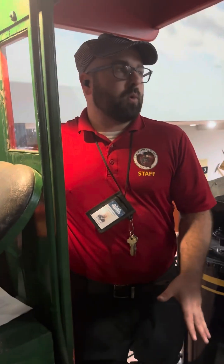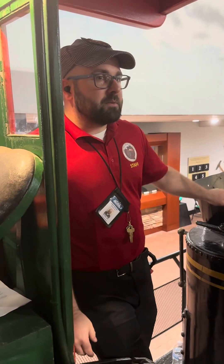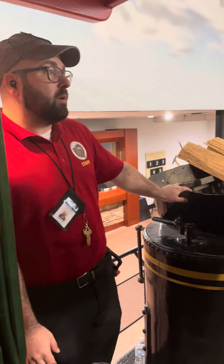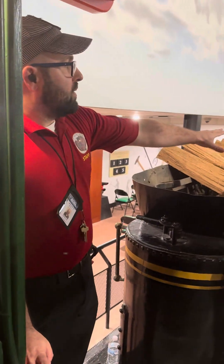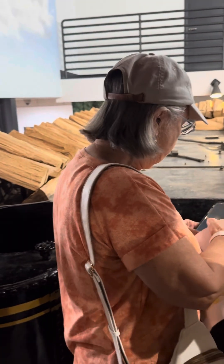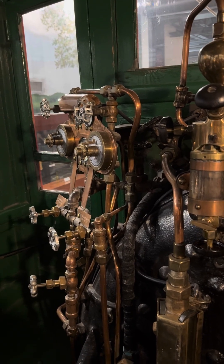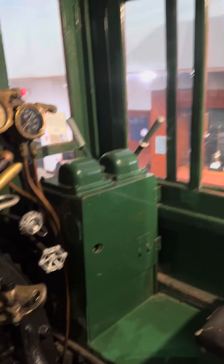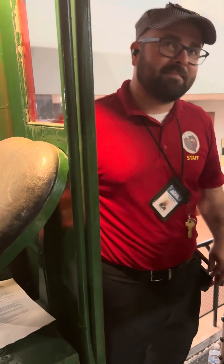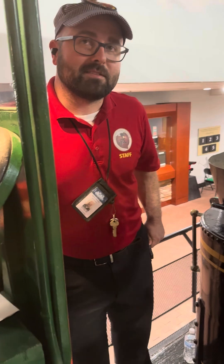This was actually in operation before the Civil War, all the way up until 1891. It was damaged during the Civil War and repaired, but then basically just 50 years of history. It was retired in 1891 and put on display in Chattanooga, Tennessee for many decades, and then it was converted to run on oil fuel in the 1960s during the Civil War Centennial. You can see the oil tank right here — it's wedged into this tender car. This whole thing is actually a water tank, but this rectangular piece right here is an oil tank. There's an atomizer, or fuel manifold, on the left-hand side that injects oil into the firebox — that's also from the 60s. And on the right-hand side is a hydraulic brake system, also from the 60s. These were designed to look like they were contemporary, and I think they did a really good job — it looks like it really belongs here.